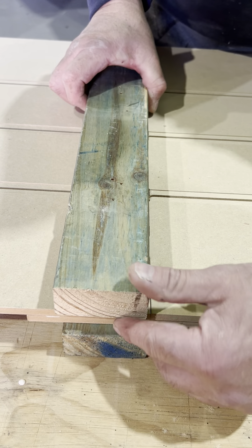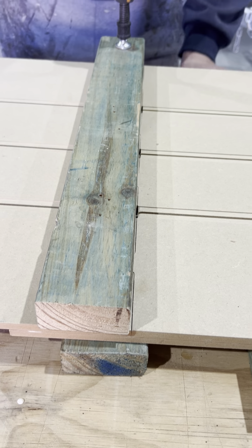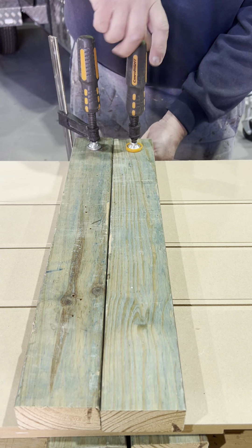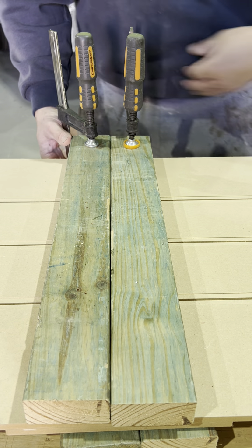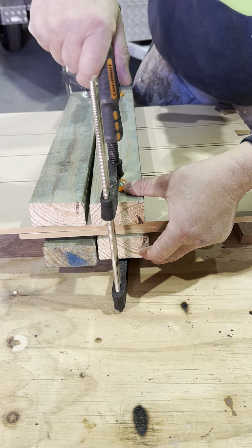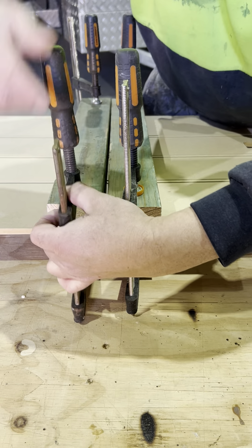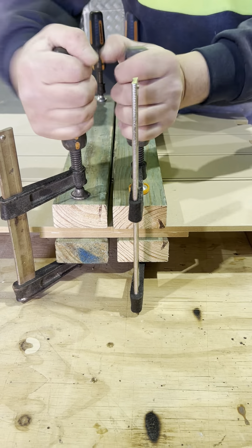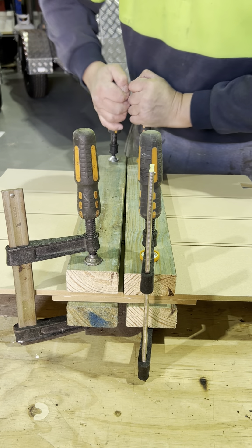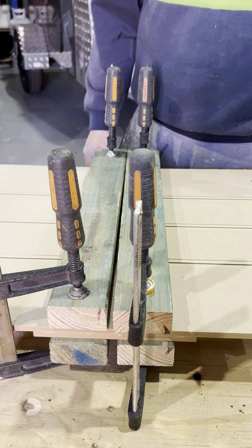Now I usually put a bit of timber on the underside — a two by three — and another one on top of the joint, and G-clamp this so that the glue has got time to dry. Put one on that side of the joint and one on this side. You may need a second person if you can't do this on your own. Put G-clamps on the other side as well and do them up nice and tight. If you don't have many G-clamps, you need a minimum of four to do one joint — just do one joint at a time. Make sure they're nice and tight and leave to dry, usually about 24 hours.